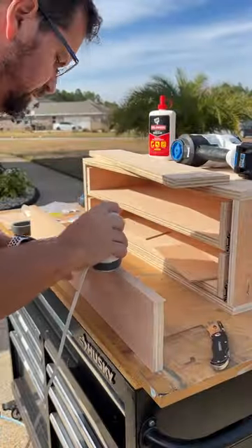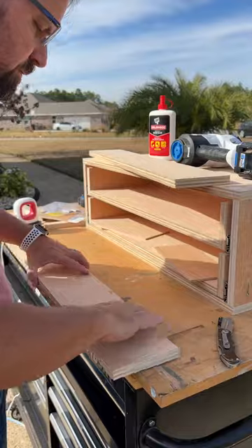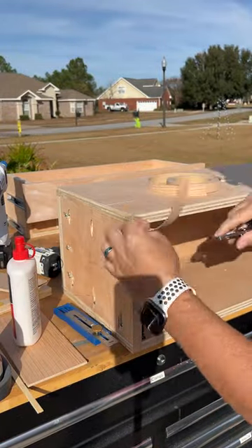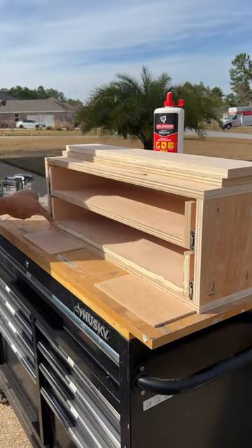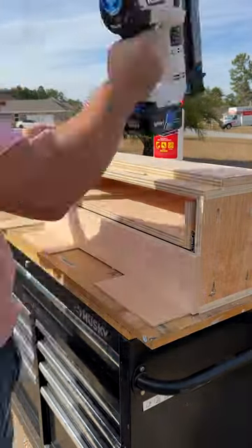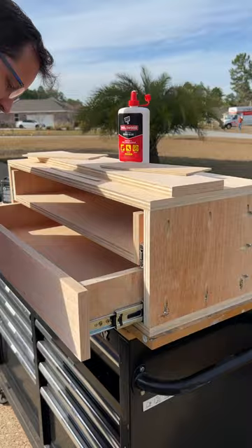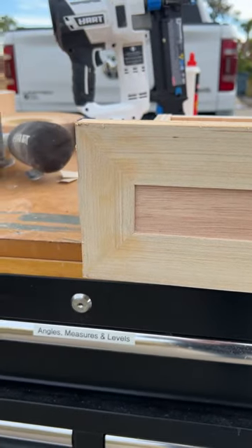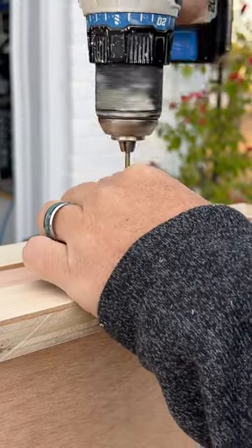When building DIY cabinets from plywood, edge banding is what separates the champs from the chumps. I did this on the two big drawers too — I just didn't film it. After edge banding, I attached the drawer faces with more glue and brads. Then I added shaker-style trim and remembered I should have done the edge banding after the trim. No problem — I heated it up, pulled it off, and installed new banding that covered the plywood and the trim. I drilled holes for knobs and then caulked around the trim to soften the transition.